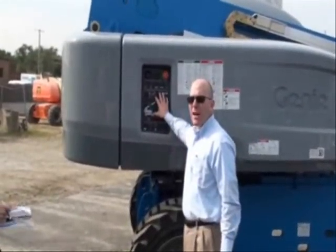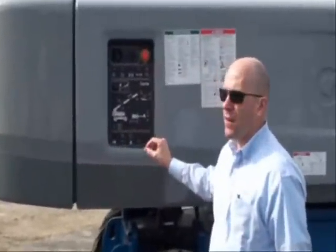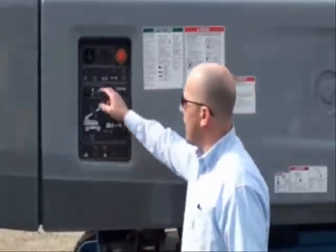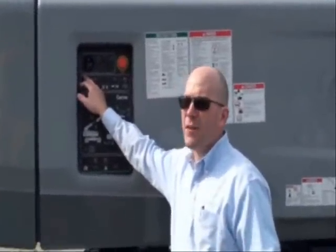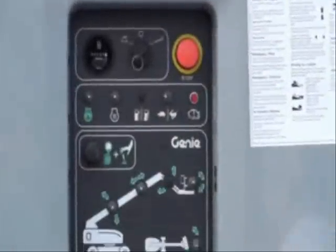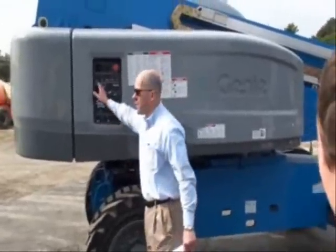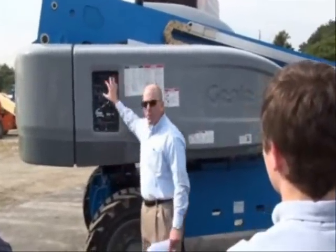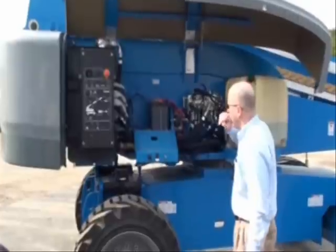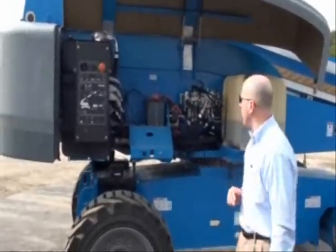Not necessarily rocket science, but a lot of improvement for the user interface. On the old layout, you had all your switches but needed a schematic to understand them. Now it's very easy to see how to operate the machine. We've done things like piloting the starter switch so it's easier to find — a lot of this is from user feedback. The enable switch is a larger switch, with the exception of the kill switch, because users told us that with gloves it's often difficult to operate. We made that a lot larger and easier. Opening up here, you have your hydraulic tank, your fuel tank, and this is where accessories like generators and a second battery go.